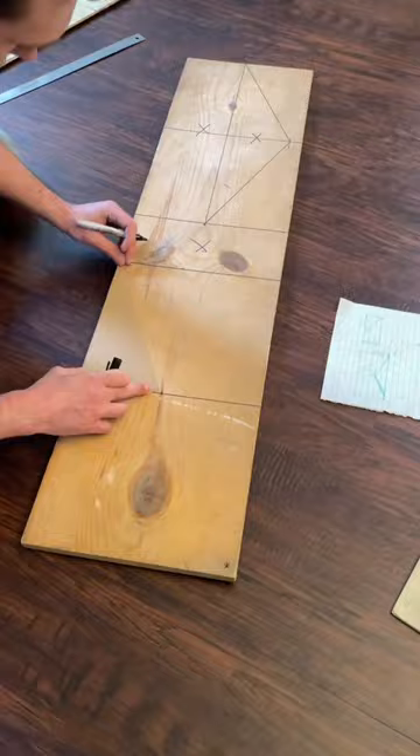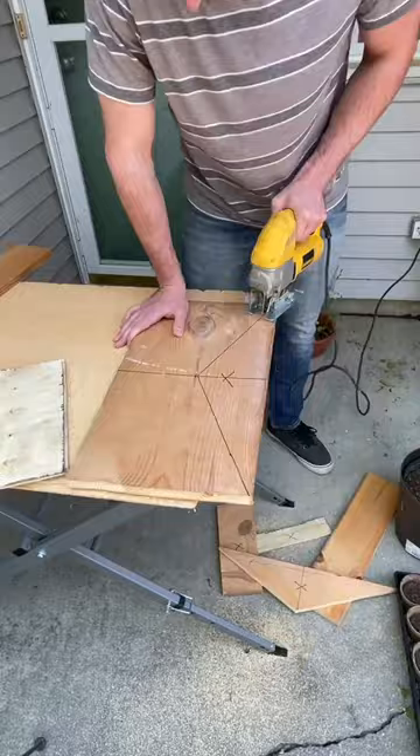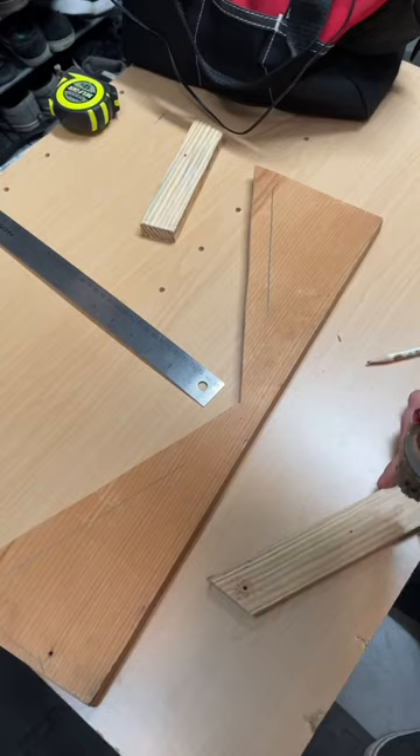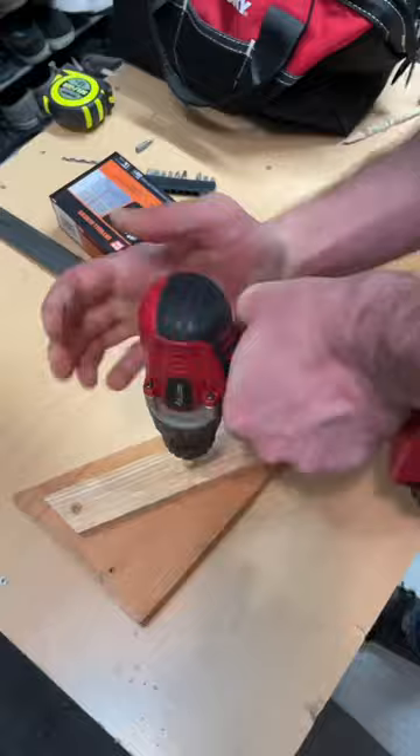Using the size of the portfolio book as a starting point, I measured out the dimensions of the pieces I would need, then proceeded to cut everything out using a jigsaw. I also sanded everything down to ensure there weren't any splinters. Because I don't want the book to slide off, I also attached two blocks to create a lip on the edge of the stand. Another good rule of thumb is to always drill pilot holes in the wood first, before putting in your screws.